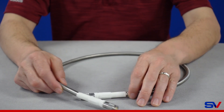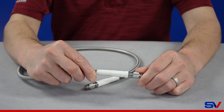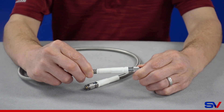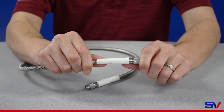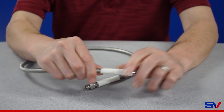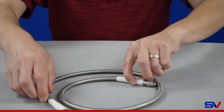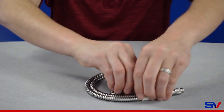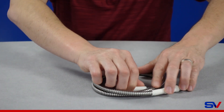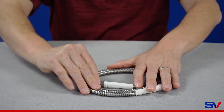Here is an example of one of the RF armored cable assemblies. You can see that underneath here is where we have the overlapping dual wall shrink tubing that enforces the retention force requirement. These also fold very well — they remain very flexible while in the armor, as long as you're not violating the minimum bend radius allowed on the cable inside.